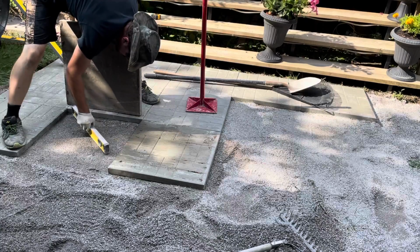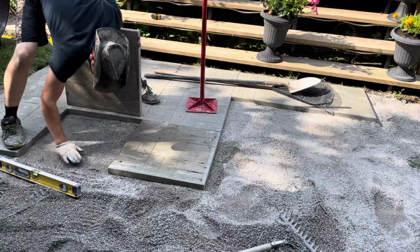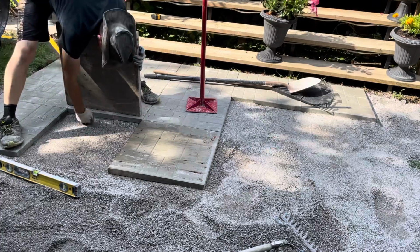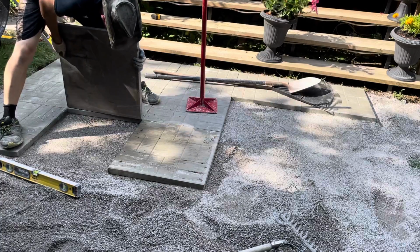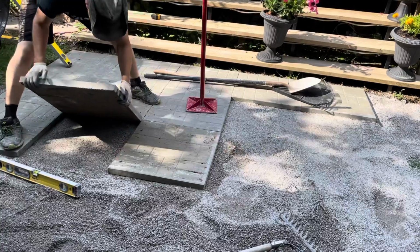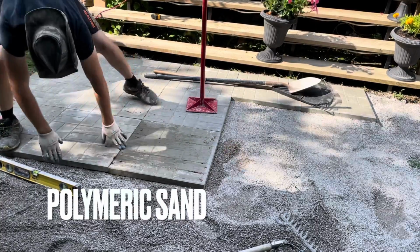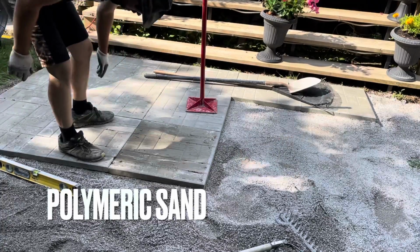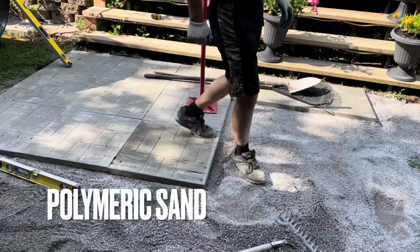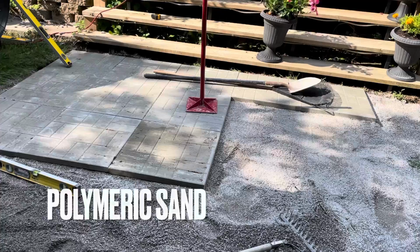So as you go, when you see a patio stone not lining up properly with the other ones, fix it. This patio is not supposed to be perfect, it's going to level out over the year. And then by spring, it might even have to be redone. Plants will get in between. You can use interlocking sand to prevent that. But we're going to keep our seams very, very tight, so I don't have to worry about that. I fixed the slab, put it back down. It matches the one that we put down at the beginning of the video, and we are happy.